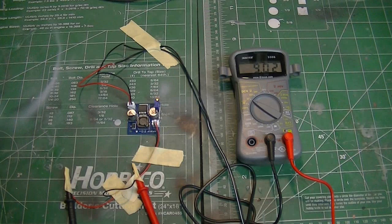Hi guys, Boyd here with Trekworks again. I've got something pretty interesting on my workbench today. On my NX-01 build I'm using a couple of different systems for lighting — the Tenet Controls board which runs at nine volts, the Monsters in Motion lighting kit which runs at four and a half volts, and LED tape for the saucer which also requires nine volts. That presents a problem where I need separate voltages, and I didn't want to run more than one power supply — just bring nine volts in and drop it down to four and a half.